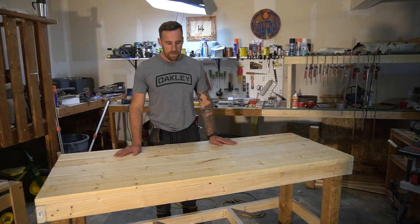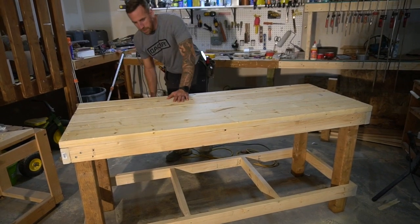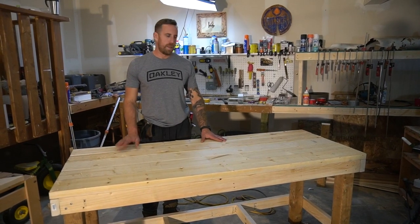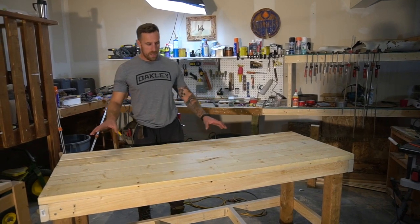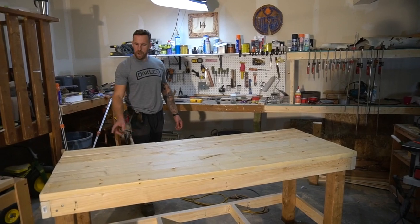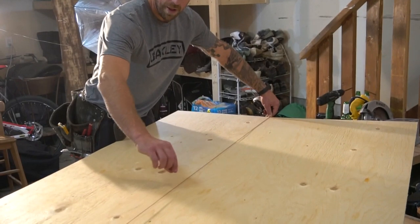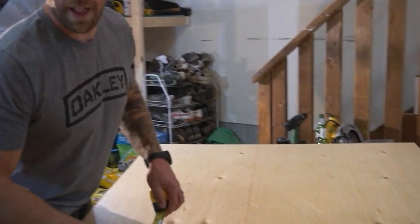We have the bench just about complete. We could leave it like this and save some cost, just put some two-by-six on the bottom if you wanted to. But we decided to add some plywood to the top — it just helps with the finish and looks better. We're going to cut a sheet to fit the exact top, and also cut a sheet to fit the bottom, which means we're gonna have to notch out our posts. We know our table is twenty-seven and a half wide, so we chalk a line at twenty-seven and a half, and it's six feet in length.